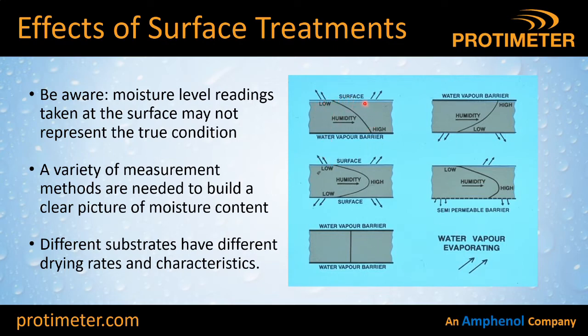Here are some different examples of how drying can take place. In the first example, the bottom surface is sealed and only the top is open. On a mezzanine floor where both top and bottom surfaces are available for air drying, your highest humidity would be on the centre line of that slab. If you cover both top and bottom surfaces, moisture will be uniform throughout the slab. If the top is covered but the bottom is open, you get roughly the inverse. And if the top surface is open but the bottom has a semi-permeable barrier, your highest moisture content would be skewed off-centre towards the bottom.